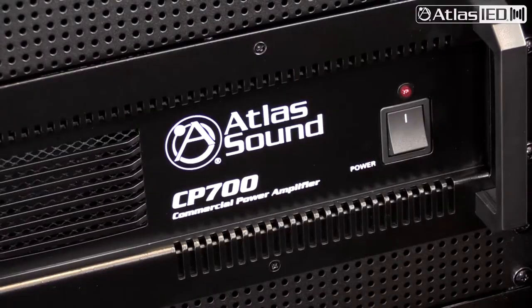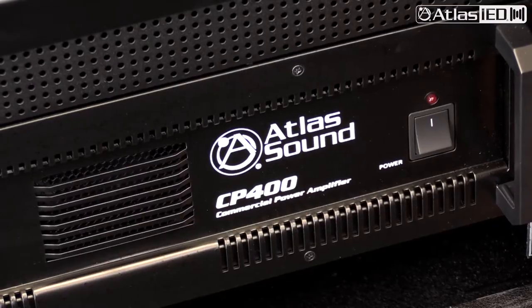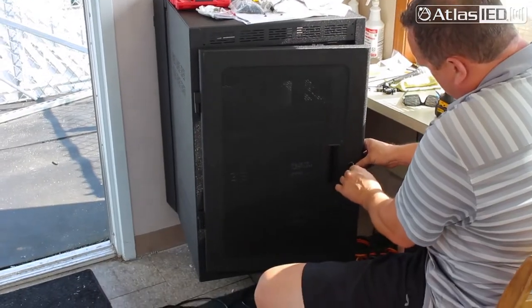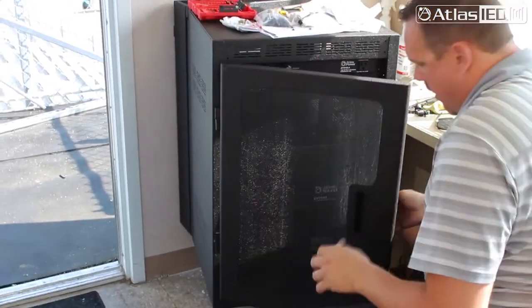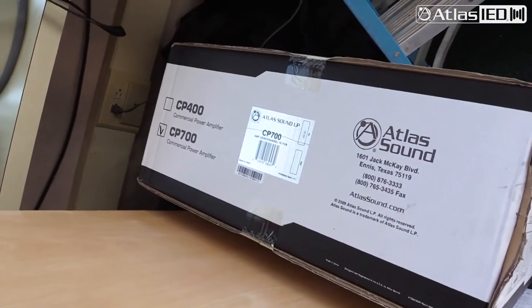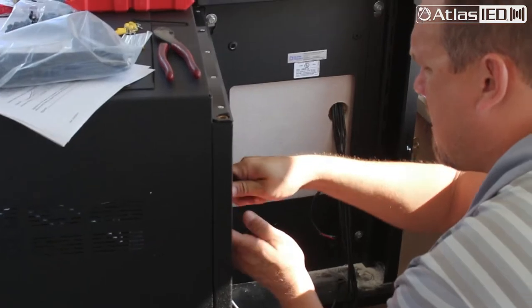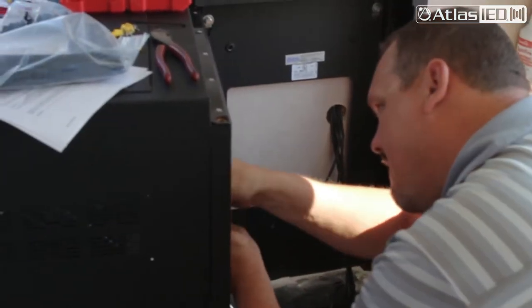With the CP-Series 700 and 400 amplifiers, a nice feature is they're actually a two-channel amp, but with individual channels. You can actually run them in a 70-volt and an 8-ohm direct impedance situation for each channel independently. In this situation with the H-series horns, we ran everything in a direct impedance situation for full coverage. If we need more coverage later, we could individually change one of the two channels to 70-volt from 8-ohm — so each one is a two-channel, fully independent amplifier in one chassis.